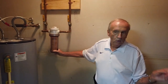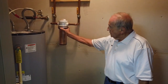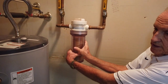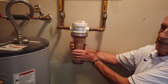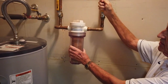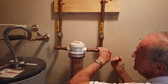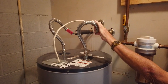It was originally made by Whirlpool, but they quit making them so 3M makes them now. All you do is turn this part to cut off the water, then turn the housing counterclockwise to get it off, change the filter, put it back on, and turn it clockwise to tighten — hand tight only. Turn it back on. Up here, these two things are the inside cutoffs for the water. Pull them down like this and it cuts them off. This one cuts the hot water off if you ever need to do that.